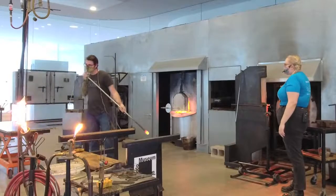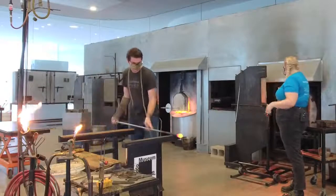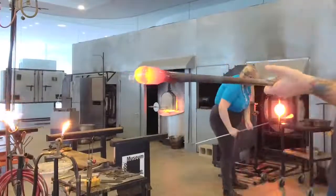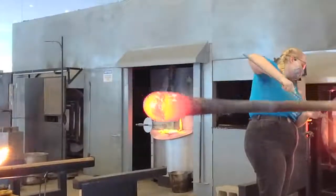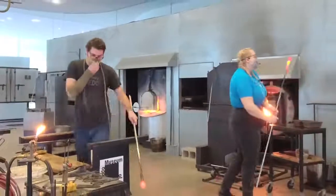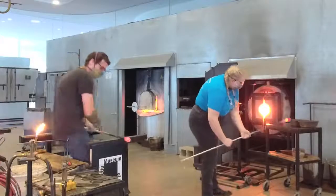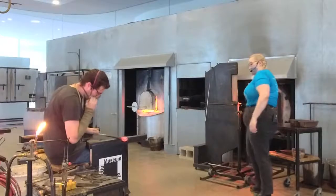He's got himself a nice little starting setup. He's going to blow at the end of the pipe and stick his thumb right over that hole, and that's going to trap the air in there. Since the air doesn't have anywhere else to go, it's going to go straight through the pipe. You can see that cute little bubble. It's easier to put in a bubble while the glass is still small — if we gathered all the glass first and then put in the air, it would take a lot more pressure.